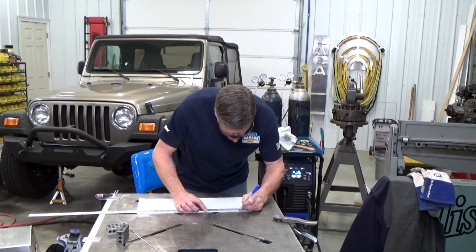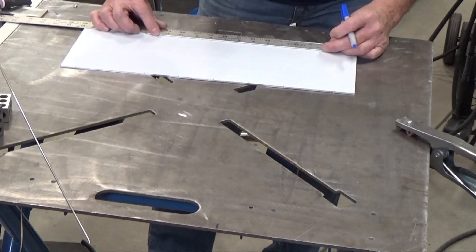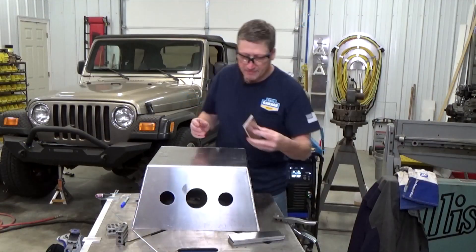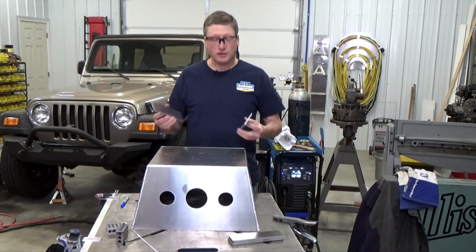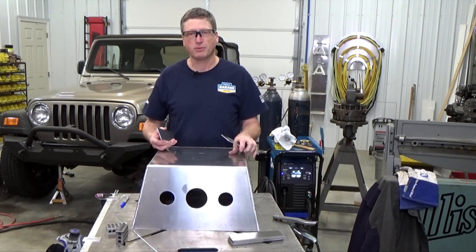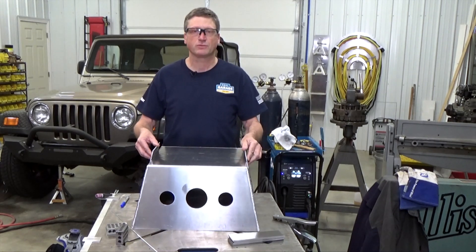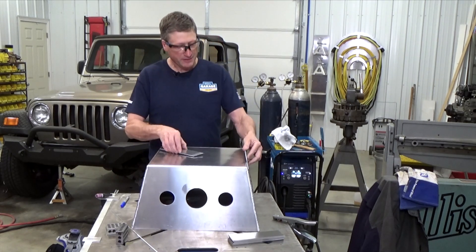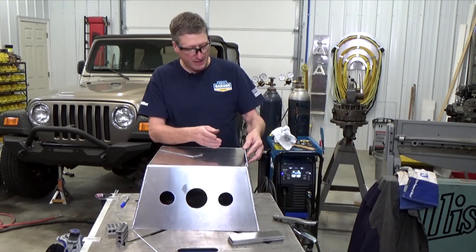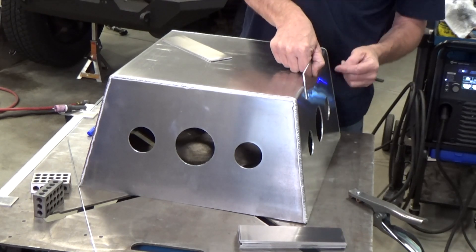You should have another piece of drop-off about eight inches wide by 19 inches long — that's enough to cut eight pieces 2-1/4 inches by eight inches. These are going to be welded on the outside, in line with the bottom support tubes. They basically serve as a tire stop in case the vehicle rolls on the stands. They're going to be welded about halfway up, so that's about an inch to an inch and an eighth. Put a two or three inch weld on the inside and then weld the outside corners.